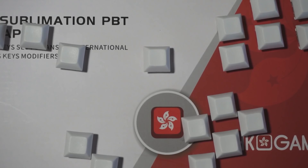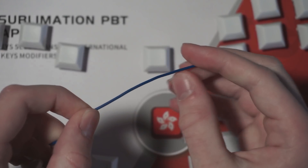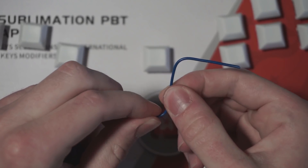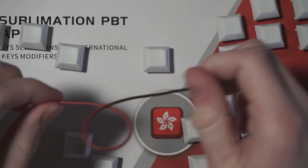If you do use keyboard switches, I would recommend 22 gauge wire, either stranded or solid core. I'm going to be using solid core because I like the rigidity of them as it makes cable management more clean. Measuring out each wire and bending them to the right shape takes a lot of time. If you use stranded wires, they're really flexible and you can use whatever length, and they'll all just kind of spaghetti into place. It's up to you which one you want to use.